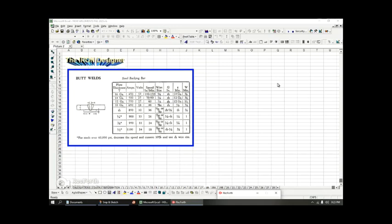Now here is the next slide that you need to interpret as a weld engineer avoiding weld failure. What they're talking about here is the same butt weld, but they're putting in this plate called the backer plate. Sometimes the backer plates just stay with the weldment. They never take them out because the root of the weld down here actually melts the backer plate, and then the backer plate just stays along for the ride with the weldment. But here's the issue. Here's the backer bar. If you have a quarter of an inch thick backer bar, this is the backer bar they're talking about.